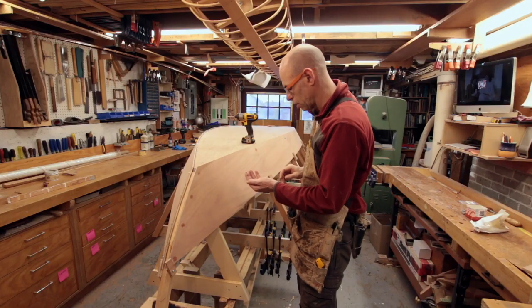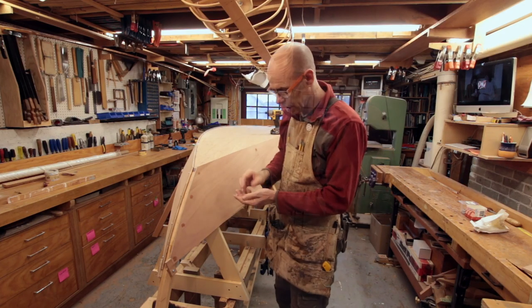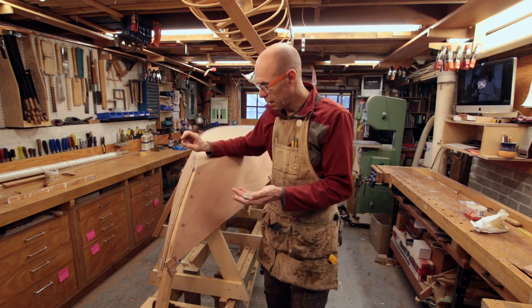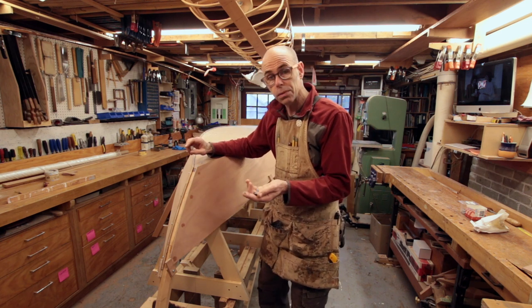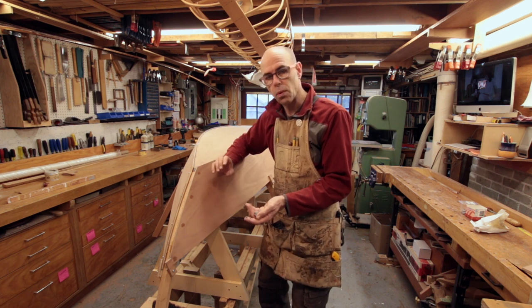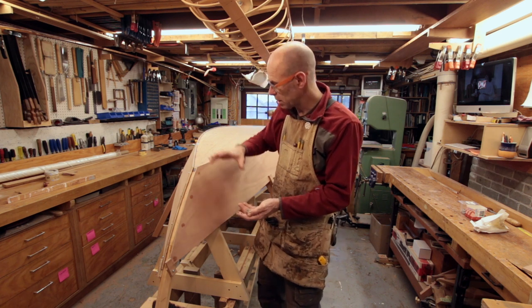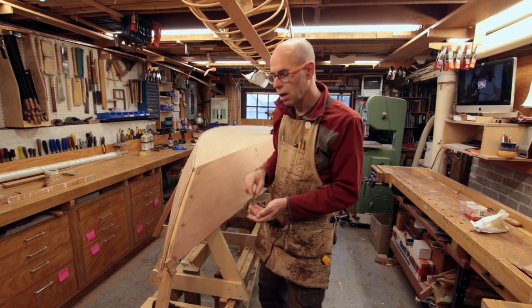Now, before driving any of these fasteners in, we made sure to coat them really well in wax. I make my own wax paste for this sort of application using beeswax and turpentine. Any furniture wax will work fine. Another really good alternative, actually, is to get a wax toilet bowl ring. It's a nice sticky soft wax that you can just keep that ring easily available and you just drop screws into it.